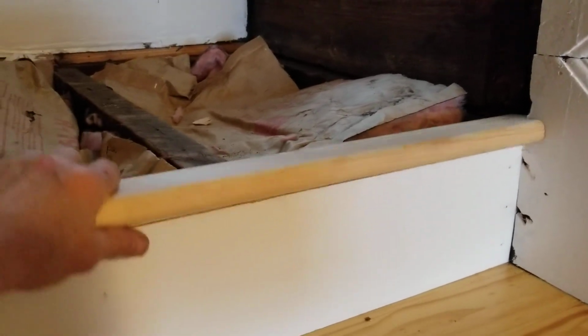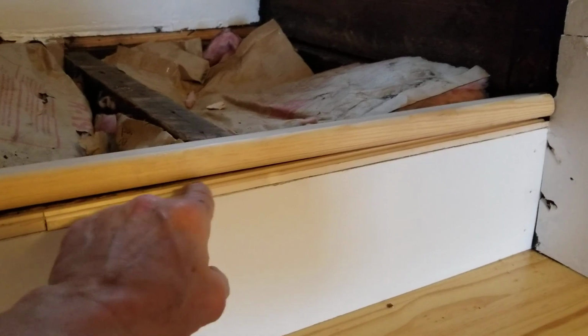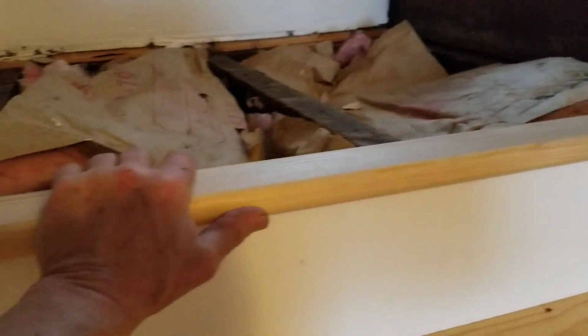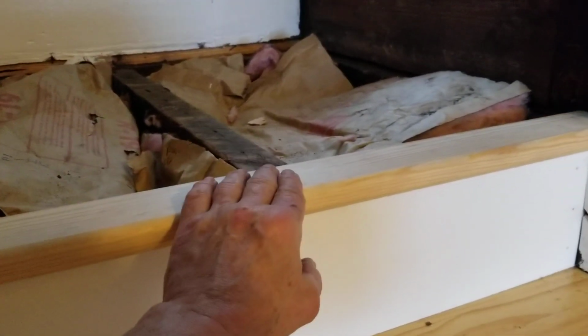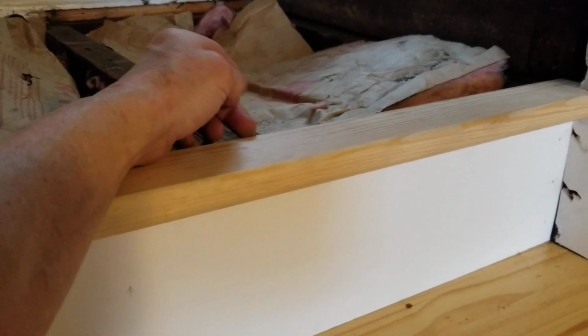and that's going to sit on there like that. I did have to put a little filler piece in because this riser didn't quite go up to the level of this platform here. So I put a little riser in there just to bring it up high enough, and that's going to set in like that. Now we're going to have some glue assist on this, and we're going to toenail it in this way.